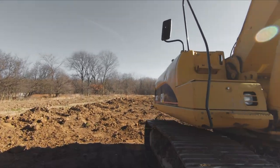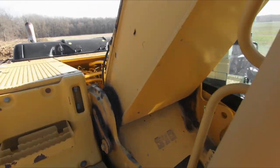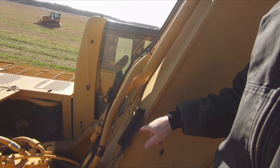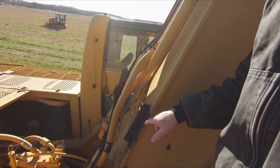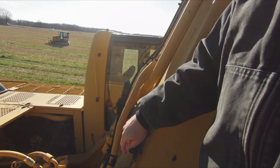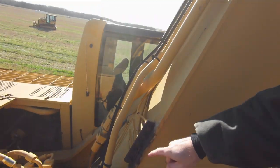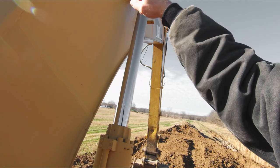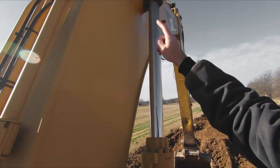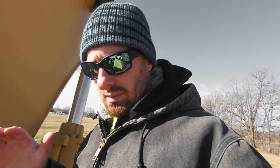Make sure you grease the turntable. You've also got your boom cylinders here that will take grease, and that's pretty much it for the ground-level stuff. Then we're going to move up onto the machine. Right here on the side of the boom is the grease block I was telling you about. You're going to have multiple grease points here — this greases parts of the boom itself, the long pin that runs down here, your boom cylinders at the top, and your stick cylinder up at the top that you can't reach from the ground. That about sums up greasing the machine, and it needs to be daily.